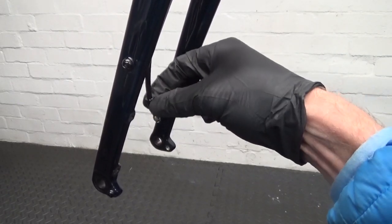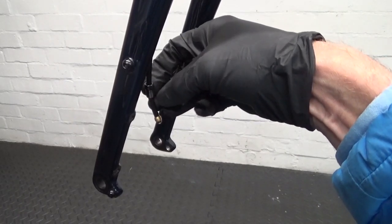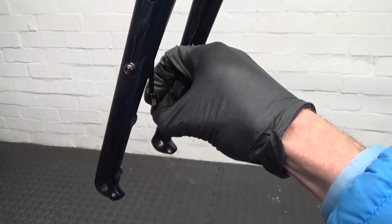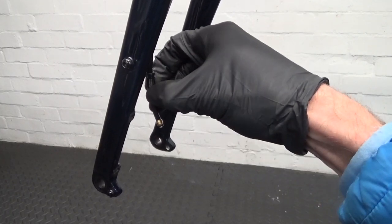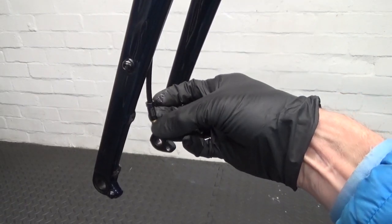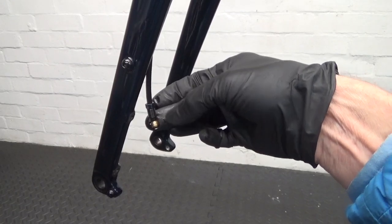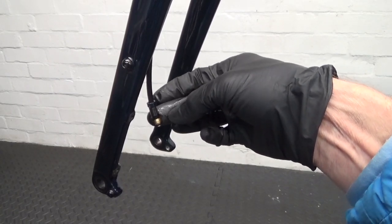You can't just cut the hose anyway because it's got the pin up inside there — if you're cutting it, all you're doing is shortening the length of the hose up the top, which you don't really want to do. So that's one way to get that olive off, especially if it's crushed right up and you know it's going to leak again.